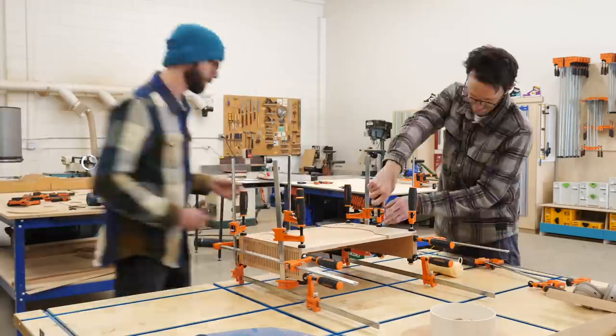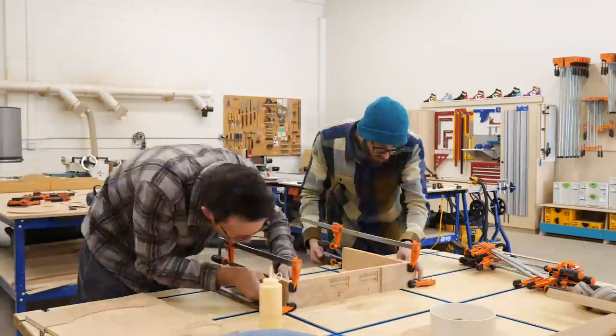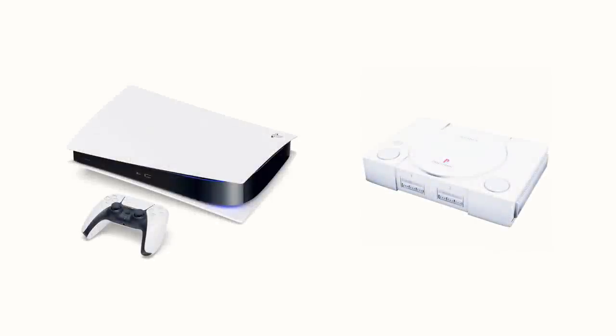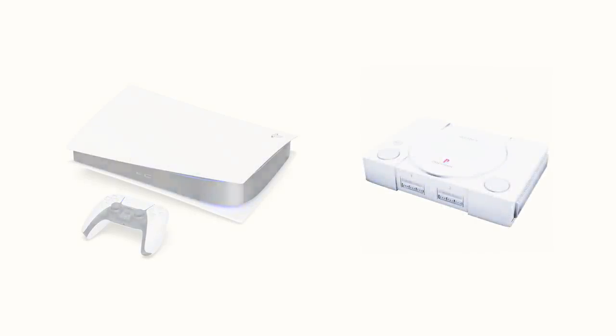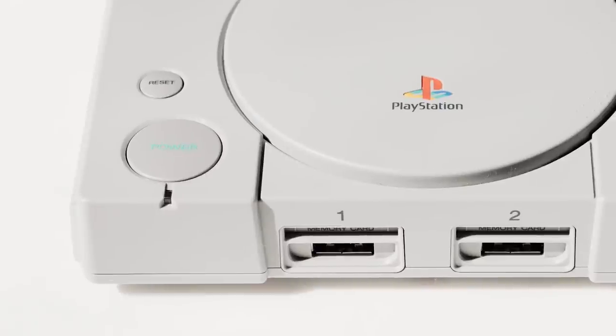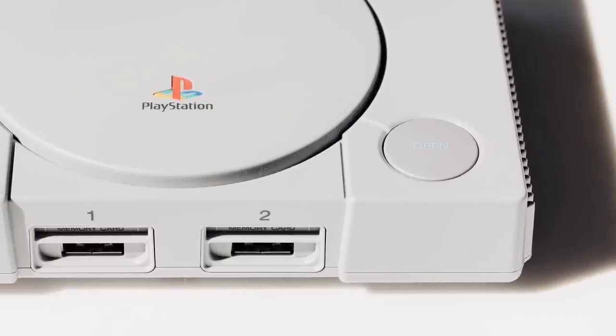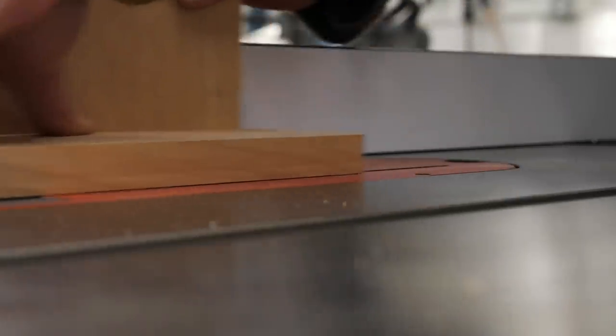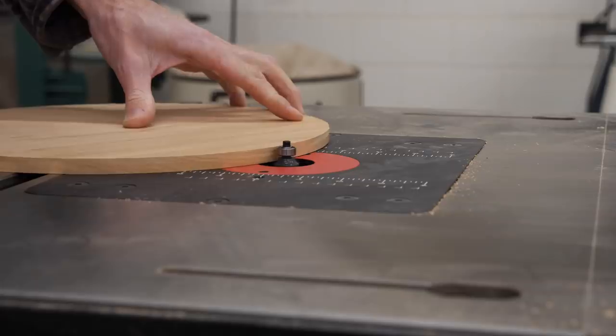By this time the shell was dry enough that we could pull it out of clamps and get back to work on it. That started by sanding it to clean things up. At this point it was looking okay but definitely not right — everything was still just too square, maybe more like a VCR from the 80s rather than a PlayStation from the 90s. If you look at the PS1, there really aren't any sharp edges — everything's rounded over, probably due to the manufacturing process. So we needed to bring that into our piece to really capture the right look. After cutting in a little line that runs along the perimeter of the PlayStation towards the bottom, we put a round-over bit in our router and started softening all of the edges.